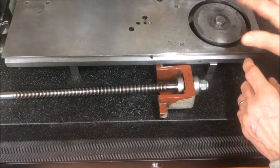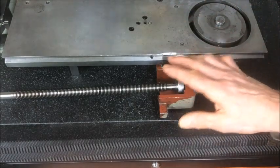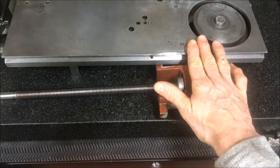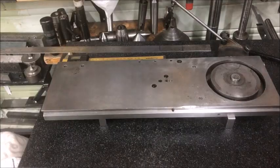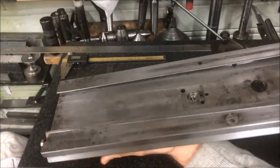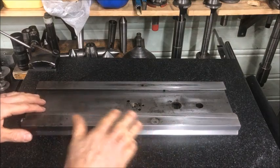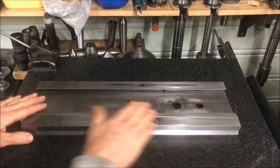I will first undo this plug here before I start to measure. I'll leave the screw for now and measure up this plus the saddle first. The first thing I'll do is press out the plug here, because this is just pressed in. Then after being absolutely certain there's no grit on the plate, having cleaned that, having cleaned this part, having stoned it, then you can try to measure.